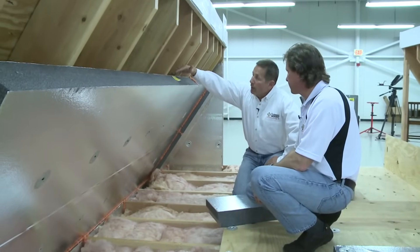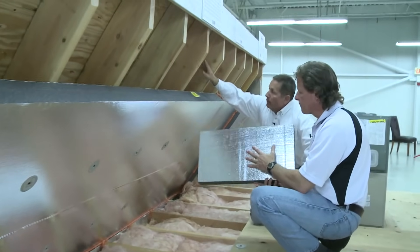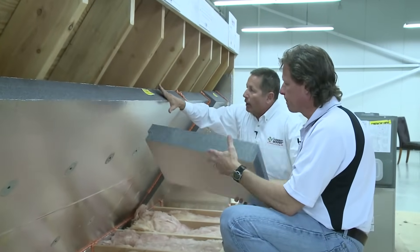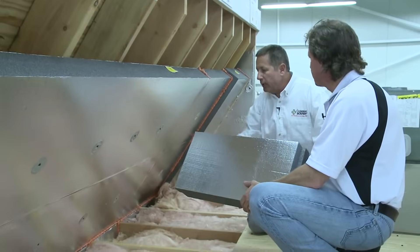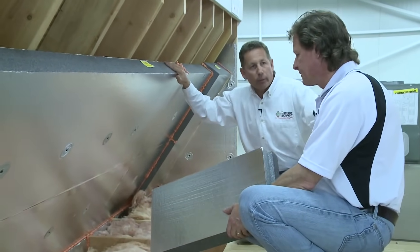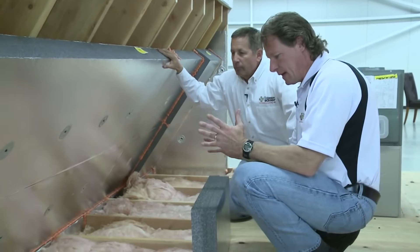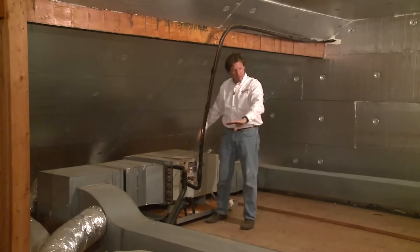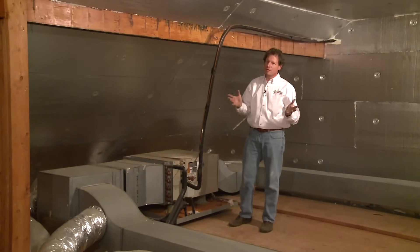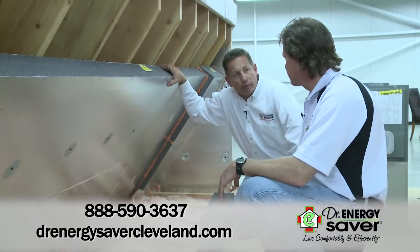We also have one more important thing: this has a radiant barrier on both sides. So the heat that's working its way through in the summertime is being reflected back out to the outside, which is going to help keep the attic cooler in the summer. And the barrier on the inside will help reflect heat from the attic back into the attic in the winter, maintaining a warmer attic. So a radiant barrier on both sides — the insulation isn't doing all the work. Your ducts, if you have ducts in your attic, are not in a hostile environment anymore; they're in a space that's pretty close to the same temperature as the heated and cooled rooms inside your house, which means your home underneath the attic is going to be more comfortable and energy efficient.